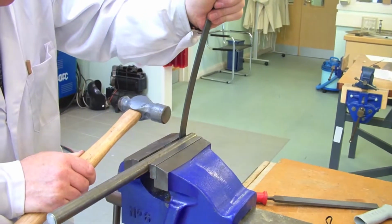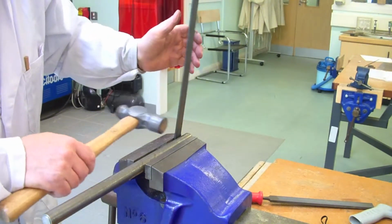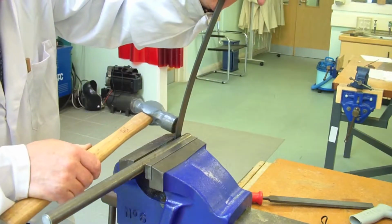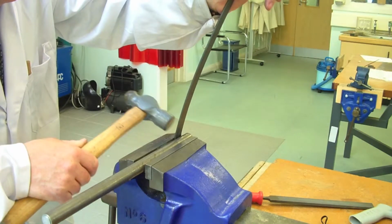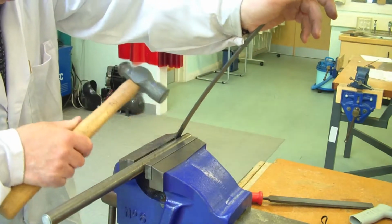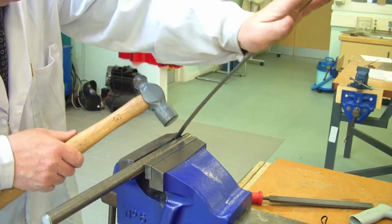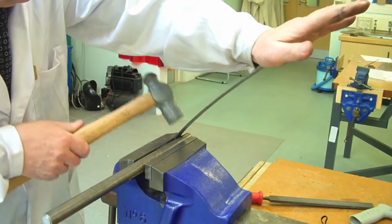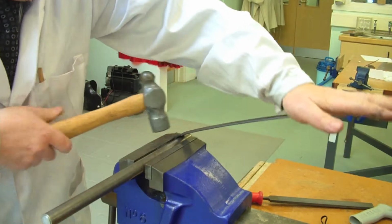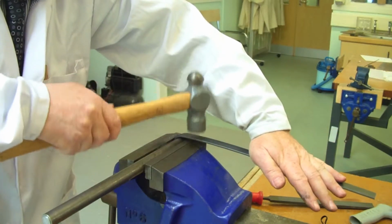Don't bend it, just press it until you feel it about to go, and then just tap. If you hit it like this here, messy, you're going to end up putting a bend in it here. So just apply the pressure, and just at that critical stage we tap with a hammer. Remember, this is all cold forming, easy to do. That goes away from you. Remember, you have to keep renewing your pressure position here. You're also not getting any big severe hammer marks into your metal.